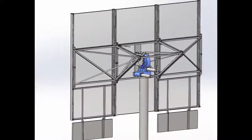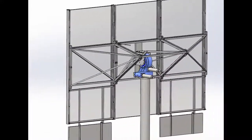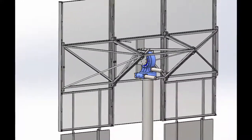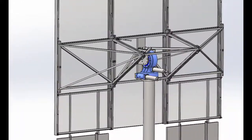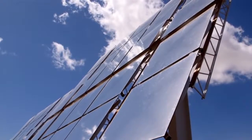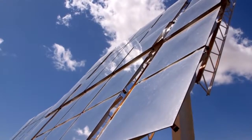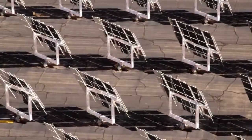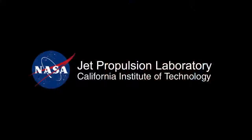In the mechanical structure, we came up with a truss-based design, which is mechanically very robust and at the same time low-cost because the amount of material used is small — and material cost really dominates the overall cost. For the actuators, we need them for both azimuth and elevation, so we looked at what is available: slew drives, linear actuators, and combinations of these as part of the cost breakdown process.